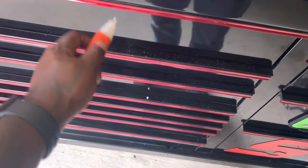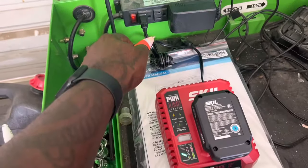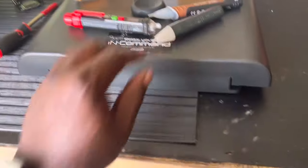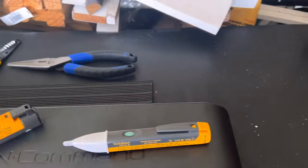You're checking the frame in two or three spots to see if it is energized, and if it beeps, you know you have a hot frame condition.